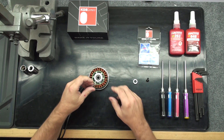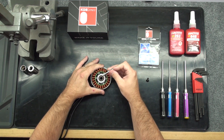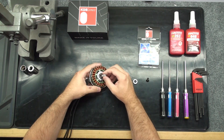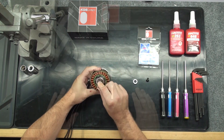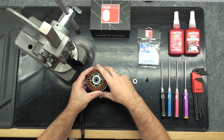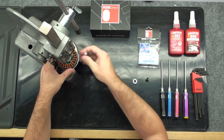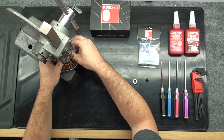Find a dowel or a bolt that can reach down through the upper bearing and make contact at an angle to push the lower bearing out. It may take changing the angle on the lower bearing in order to push it out properly. Now use your arbor press to press the bottom bearing out. Take note not to do any damage to the winding while doing this process. It may take several times of changing the angle on the bottom bearing to properly press it.